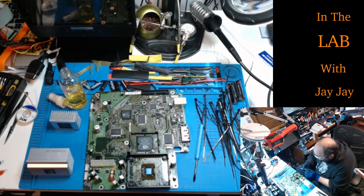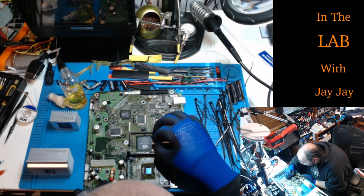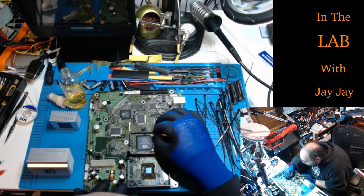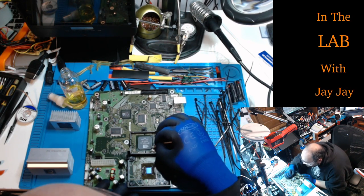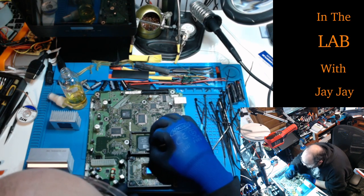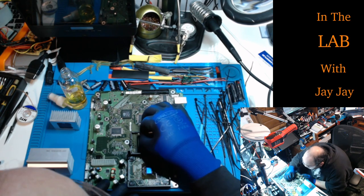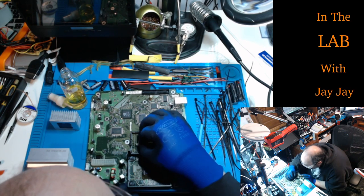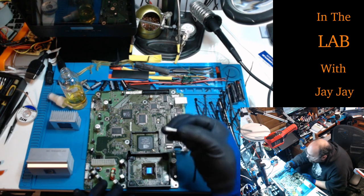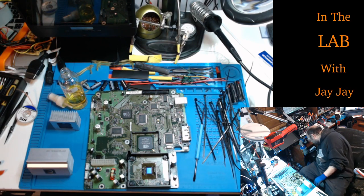The two main things to do when you're servicing an Xbox are recap the power adapter, the power capacitors, and reheat sink the GPU and the CPU. You do those two things, that's the main things. I suppose you can clean the DVD ROM as well, and you can, I guess, upgrade the hard drive, but those aren't the main things. The main things, recap and new thermal paste. You do those two things, you might manage to salvage your old Xbox.